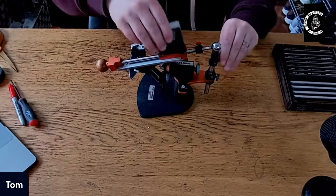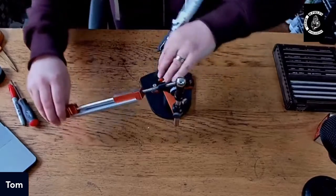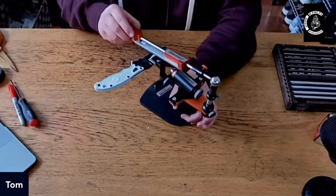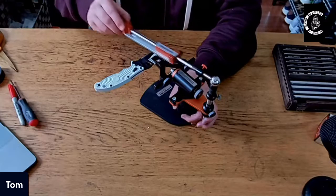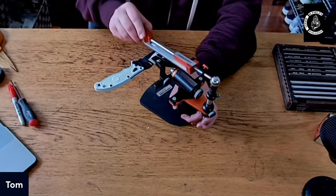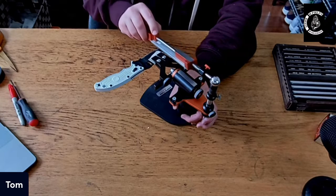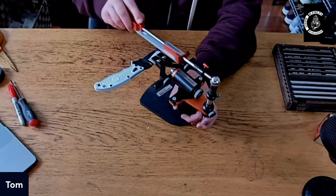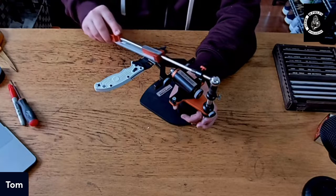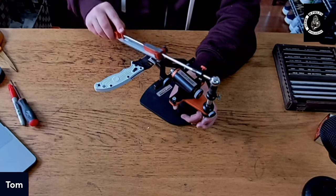Okay, so back at 17, we have our strop in there now. And we're just going to do pulling strokes lightly on the edge, trying to pull any burr off. We're polishing the bevels lightly, but the primary goal is to get it sharp, to straighten the apex out. Take the metal fibers, make them pointy at the end, take any burr and just pull it off. So let's do a couple light passes.